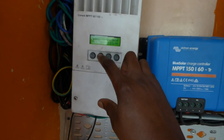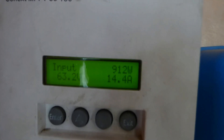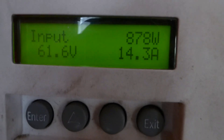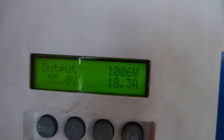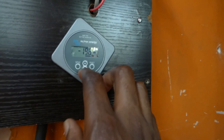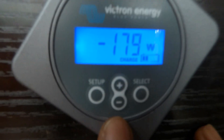Okay YouTube, this is Dr. Solar again. I have moved the PV from the inverter into the charge controller, and you can see the production here that I could never see from that charge controller before. Right now I have 1000 watts coming in, and this other one should be about 1600 to 1700 watts, so I have about 2600 watts total to confirm.